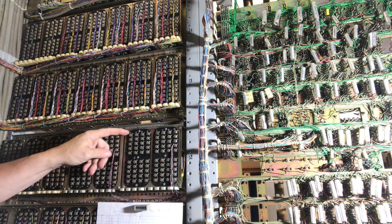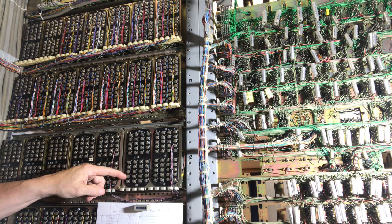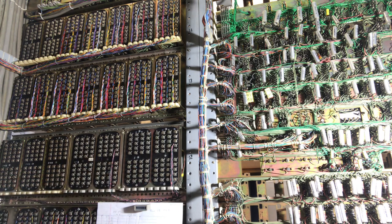So I'm going to start out wiring screw number one, number two, and then I will go down to number nine. Screw number 10, 20, 30, 40, and so forth are the control leads that connect to the telephone, so when you press the line key in the concentrator phone, you operate the relays in whatever sequence is needed for that line.